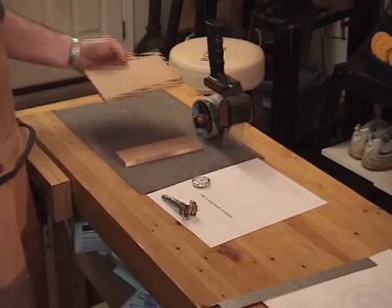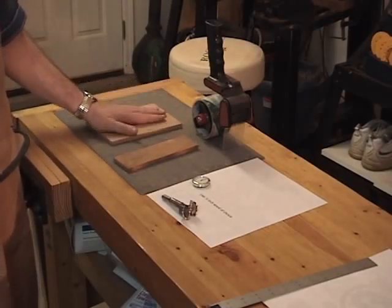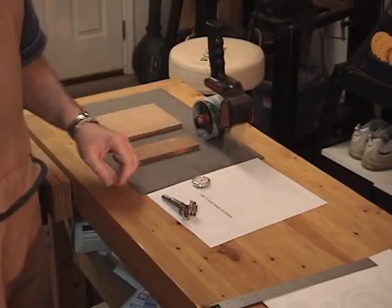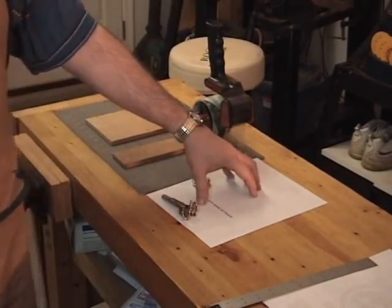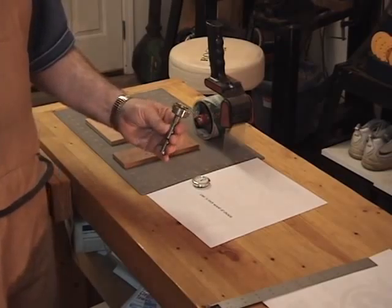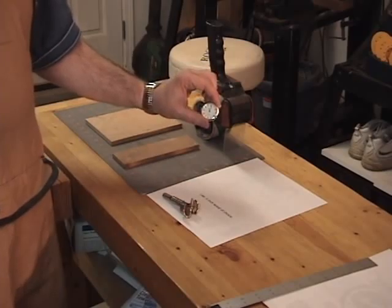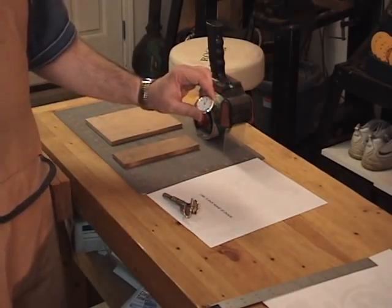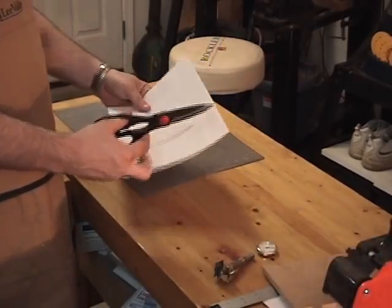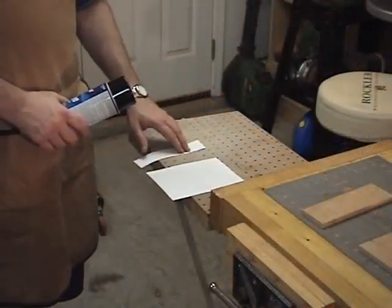I would normally use about 1 1/2 inch thickness for this project, but this will be good enough for what we're doing today just as a demonstration. I have one piece that's 7 inches by 5 1/2 inches and another piece that's 7 inches by about 2 1/4 inches — this will be for the clock and the clock base. You'll also need the clear box tape and the downloadable pattern off of the website. I have a 1 and 3/8 inch Forstner bit to drill the hole for the insert, and a 1 and 7/16 inch mini clock insert that you can purchase off the web.